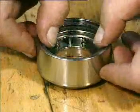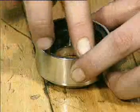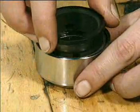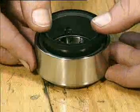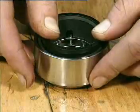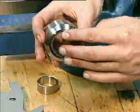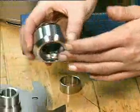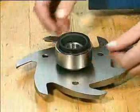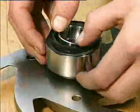Be careful when assembling the rotating parts. Ensure that the two drive pins enter the notches in the rotating seal ring. Replace the o-ring in the rotating part and mount it on the impeller hub. Replace the spacer ring in the rotating part.